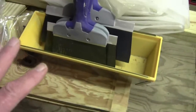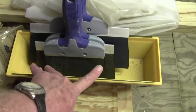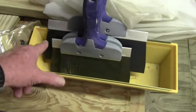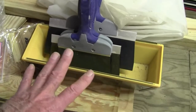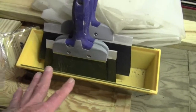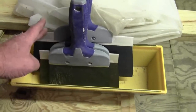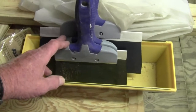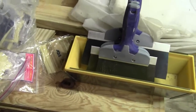To get level 5 sheetrock on seams, you have to start small and work out wider from the joint between two pieces of sheetrock. You don't put on very much each time because you don't want to have to sand so much. You put it on and you might take two or three thin coats. If you're really good at it you can probably do it with one or two of the smaller coats, and on the bigger coat you might have to do two.